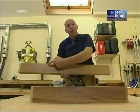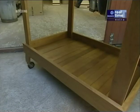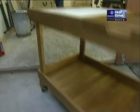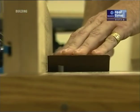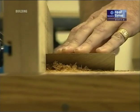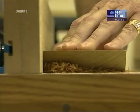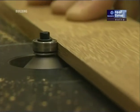The next thing I'm going to do is cut a trench in both of the long rails and I'll do that over at the router table. Those trenches will receive slats that form the storage area in the lower deck. To cut the trenches, I've installed a straight cutting bit in the router table and raised it up to make a 10mm deep trench. I've also set the fence 15mm back from the cutter. The gaps between each of the slats are intentional — there to allow water to drain away, but I think this will look a whole lot nicer if I chamfer the two top edges.